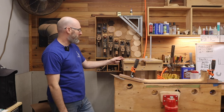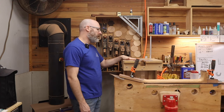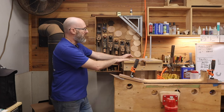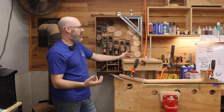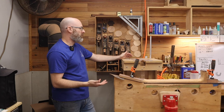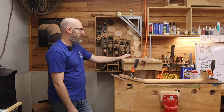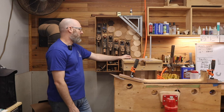This is a jig I bought from Luthier's Mercantile International years ago — it may have been part of a sponsored guitar video I did back in 2020. It's a plywood jig intended to create the tenon and the mortise on our guitar necks, and we've been using it now for five years and continue to do so. I've had to remake the templates that the guide bearing of the router rides against, but other than that we've just continued to use it. I keep saying I'm going to build something better, but I just haven't come up with something better yet.